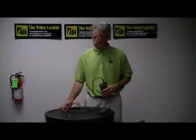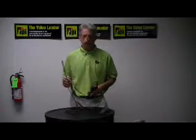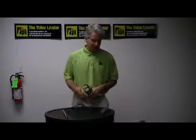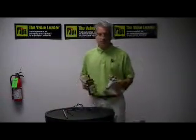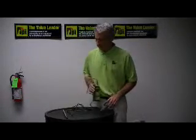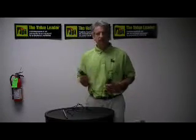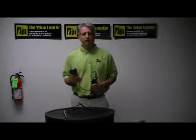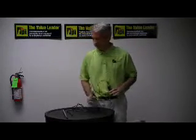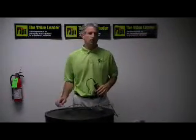The difference between the two is the hot wire is more accurate at the lower levels — down to 0.4 meters per second accuracy — whereas on the vane it really starts at about 0.7 meters per second. On the high end, the vane type is actually your more preferred method. This can measure a maximum up to 25 meters per second, whereas the hot wire is generally good to only about 20 meters per second.